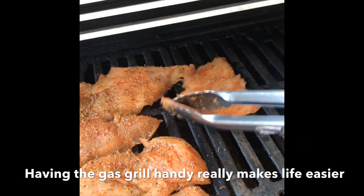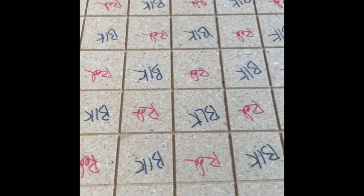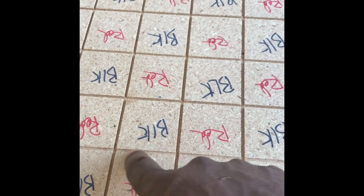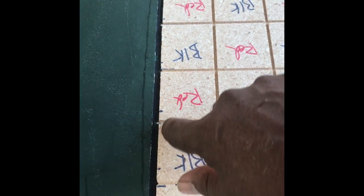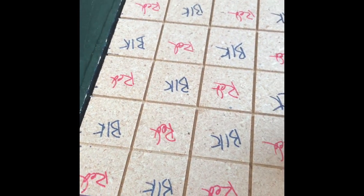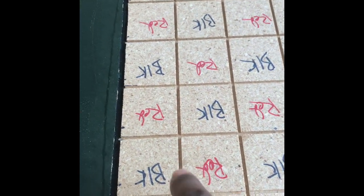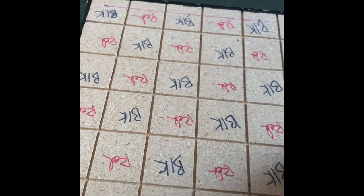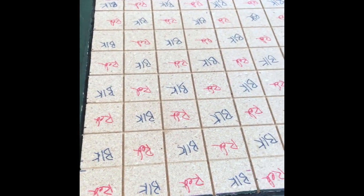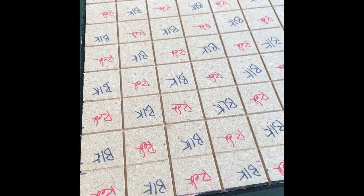When I take it inside, I'm going to fill in these black cracks with black epoxy, and these little thin lines will be filled with gold. I've got to prep it so that when I put the black in, it doesn't bleed. I'll be blocking all these little lanes and crevices off. Once that's done I'll do the gold. Once the gold is done, I'll sand it lightly all the way around to get it smooth and even, then paint these red and black like a checkerboard, sand it again, touch up the paint if necessary, and put a coat of stone coat epoxy mix on top of the whole thing.